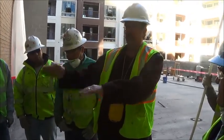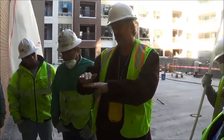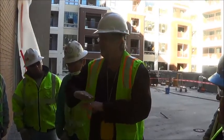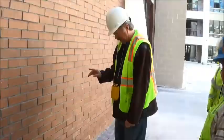Also, you can do it vice versa. So if you forgot the 250, hot first, put the epoxy on the hot, at least 4 to 6 inches, run it down over the hot to the concrete. As long as the 250 hits that concrete and the epoxy hits the concrete, you're fine. Sand it, next day 250 over top of that, you're good.